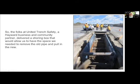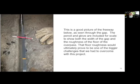But because we needed to have the bottom open, we basically ended up using hydraulic rams to keep everything apart while we're digging. And then in the longer run, what we ended up doing is backfilling some material and building up a ramp that went up to the actual end of the overpass.